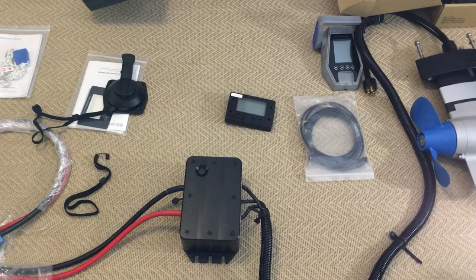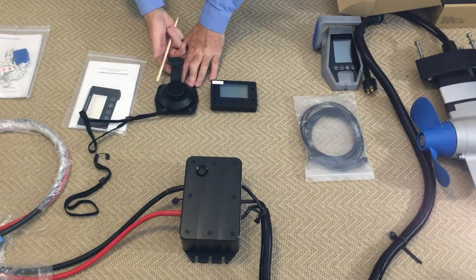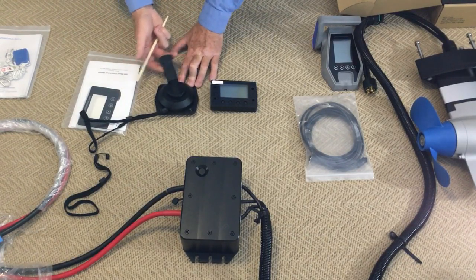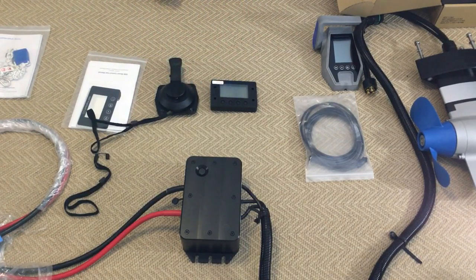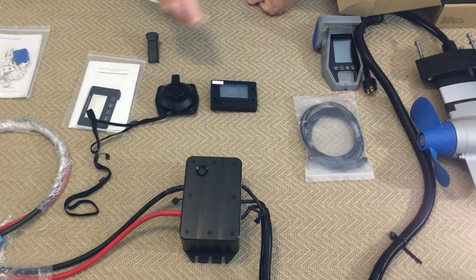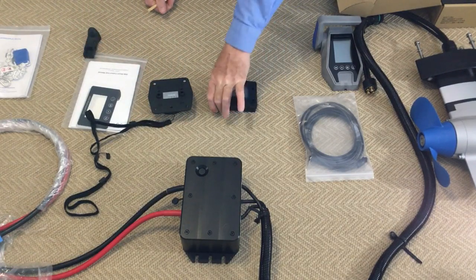Plus there's more cables in the bottom — a short and a long one. We need the short one to go between these two devices. For the operation: you can lift the lever and swing it forward and reverse, and it clicks in the middle for neutral. The top of the lever can be removed, which is a good advantage in a sailing boat because it helps to avoid the sheet — the main sheet or anything wrapping around it and getting fouled on the throttle. Four screws to hold it down and a plug at the back for the control.